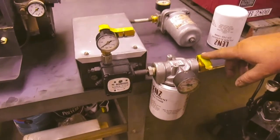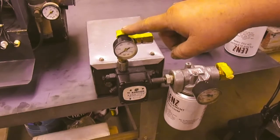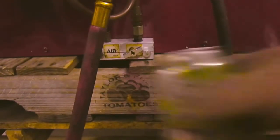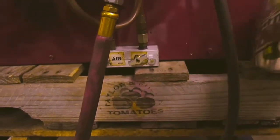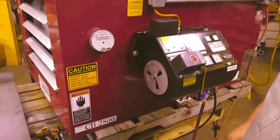This sucks oil out of the tank, filters it, and pumps it up to the burner. There's a way to measure it over here — you can open the bleeder here and make sure it continually pumps. You can measure that with a 12 ounce aluminum Coca-Cola can. There are different specifications in our book. Bottom line: oil filter gets plugged up and the burner doesn't run.